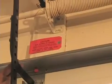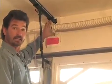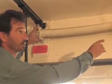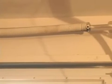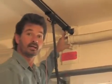Anywhere up in here, where the spring mounts together to its mounting plate, or on the other end, where you apply the actual tension to, both of those areas are very, very dangerous. And what we do to try to inform you about this is to provide these caution tags or warning tags to let you know, stay clear, it'll hurt.